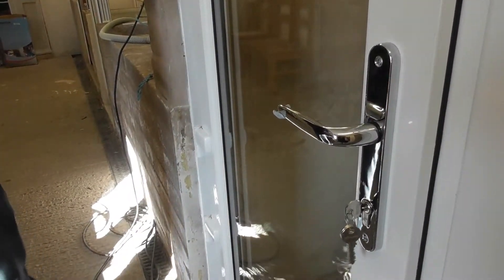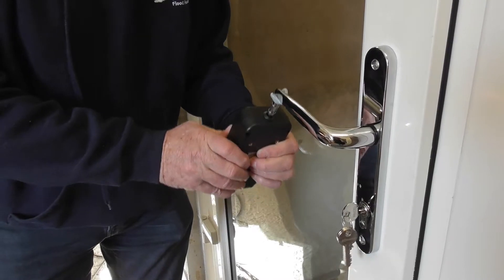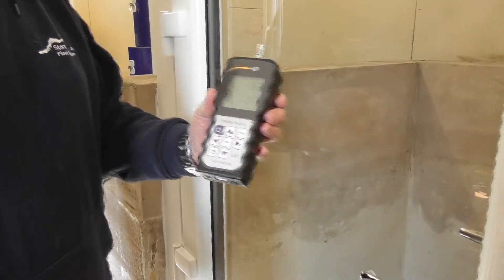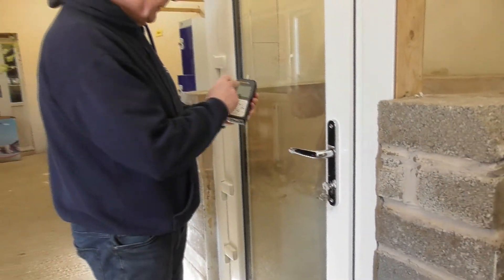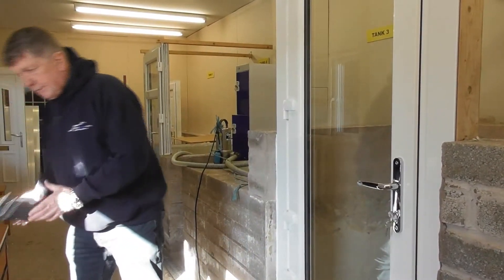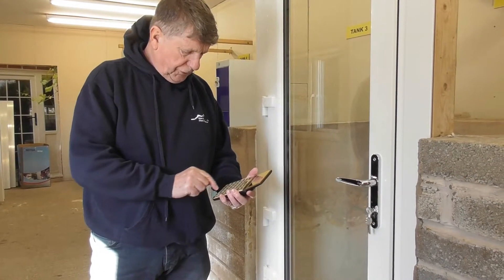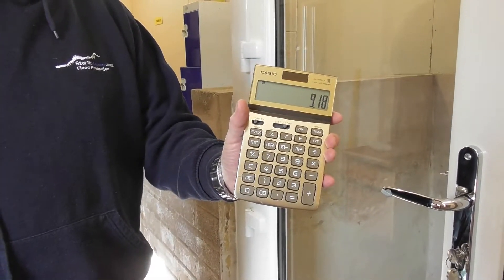Then what I'm going to do is raise the handle. I get a force there of 76.5 Newtons. Just turn the key — make sure I've raised the handle fully. So I've got 76.5 Newtons. To express that in Newton meters: 76.5 times 0.12 equals 9.18 Newton meters.